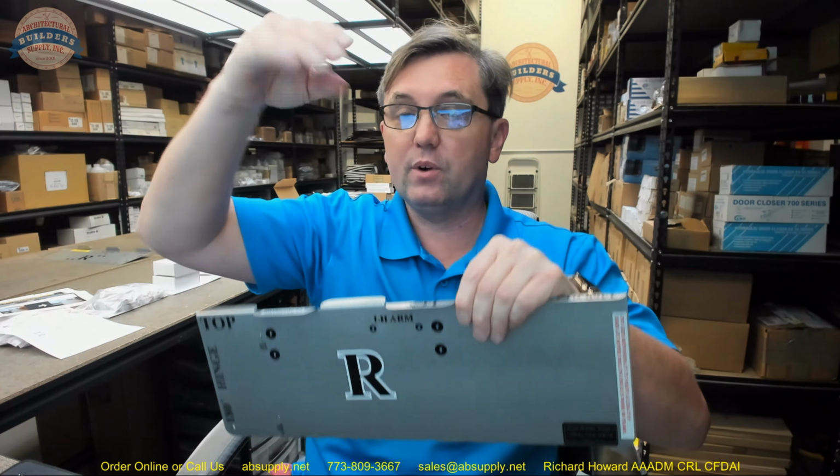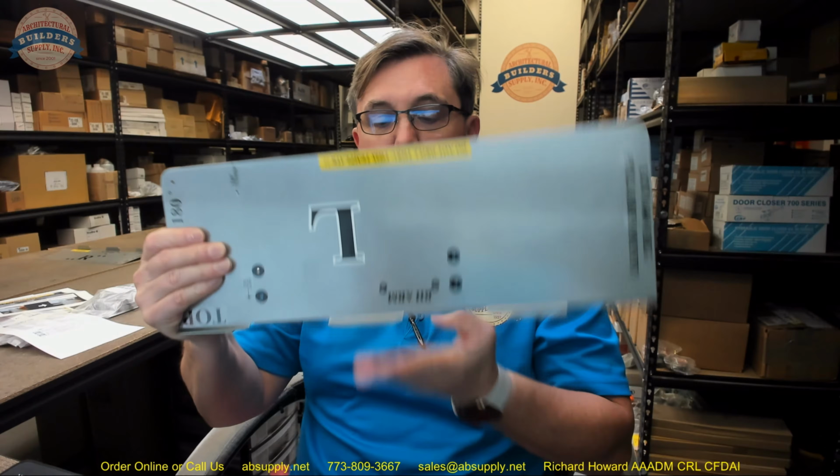And the logic from the manufacturer is, if you know how to lay it out by hand, and then you have the permanent template, you can say to yourself, how will that work? Margining this from the top of the header and letting it hang down is probably not a good idea, because they don't know if you're doing 2-inch headers, 4-inch headers, something odd. But that margin from the underside of the header will always be consistent unless you have an unusual margin. A cam lift hinge would cause that margin to be unusual, like a 3/16 versus an 1/8 of an inch, or maybe even a 1/4 inch. But that's how you'll do that. You're just going to flip it over.